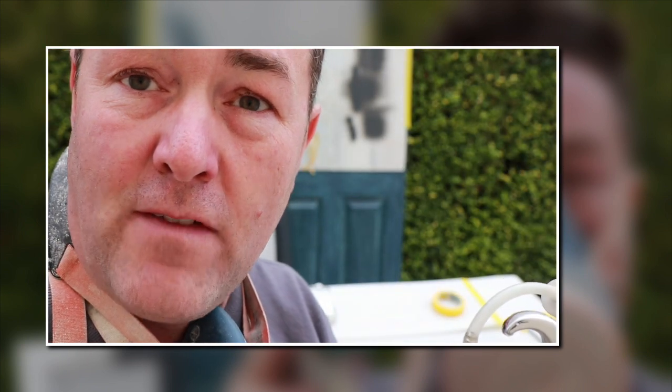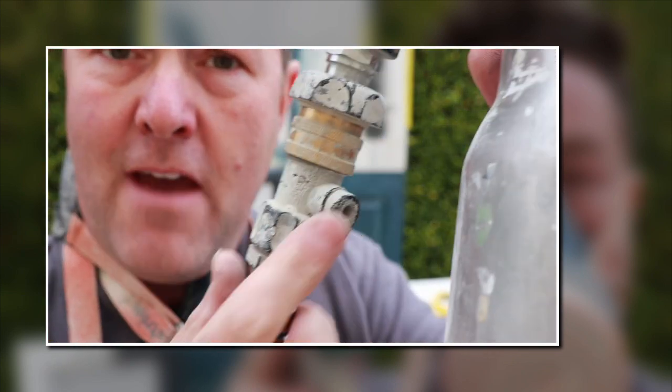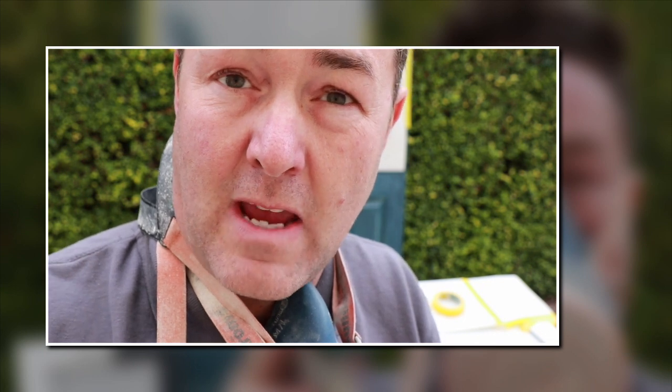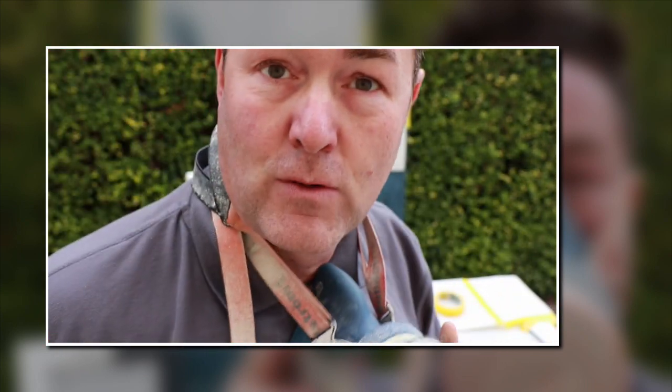My HVLP is a Stage Five QT5. Your airflow control should be the nearest to the gun. If you find you've got too much airflow, just slightly knock it down by reducing the airflow — that depends on the paints you're using and your experience. I'm outside, not too worried. I've got my Sundstrom mask on. I'm going to spray a light mist coat.